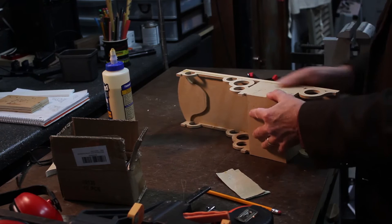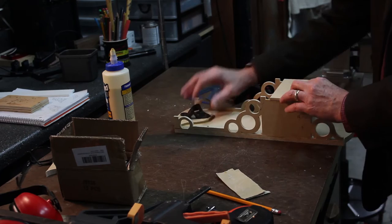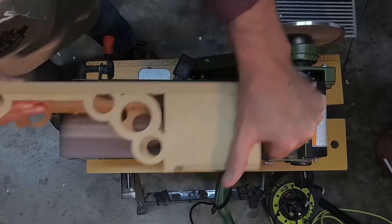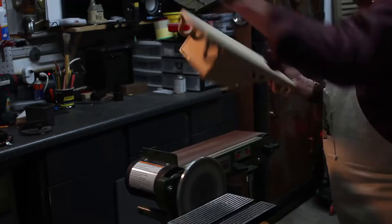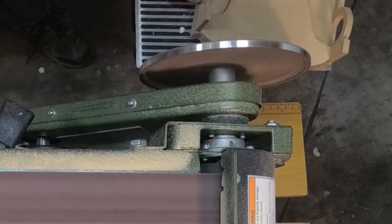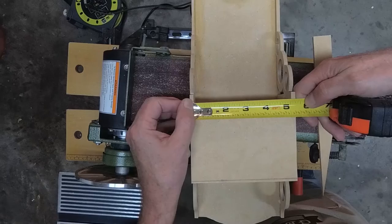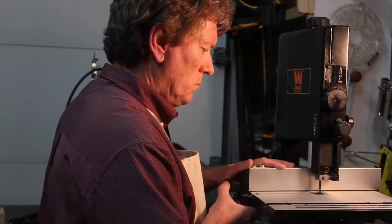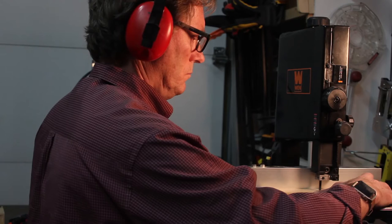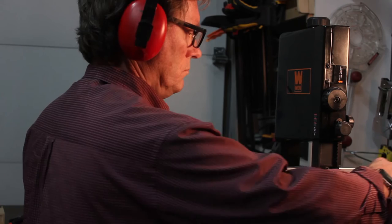Looks like it's all dried up and put together well. I think we're going to be ready to start putting some more of the decorative pieces on. I'm going to take and clean up the sides a little bit using the belt sander — you could do this with a block sander or hand sander as well, but I'll save a little time. I'm also going to use the disc part of the sander to smooth out the top and the bottom. Using basic measurements, I'm going to cut some decorative wood to go around the front and the sides. Setting my guide on the bandsaw — always wear ear protection and eye protection — I'm going to cut the strips that will go around the side of the bottle opener, along with a half-inch strip for the front to give it a little more depth.